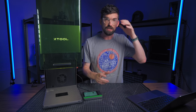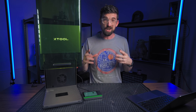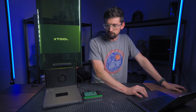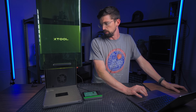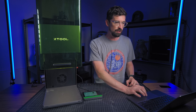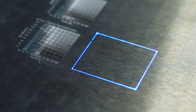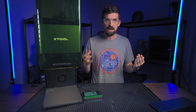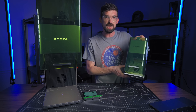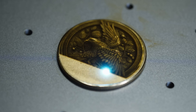The best example of this speed, beyond real-time engravings, is on the preview side. You get a red dot preview that outlines your artwork. The framing operation runs right now — try to see how well it shows up on camera. You can also set it to outline mode. The top end for square framing on this machine is 24,000 mm/s, and 16,000 mm/s on artwork outlines — excellent for alignment. Even if you cranked the F1 to 10,000 mm/s with its two-watt fiber laser, you just don't have enough power to do much. Paired with the 20 watts on the Ultra, you get usable results.